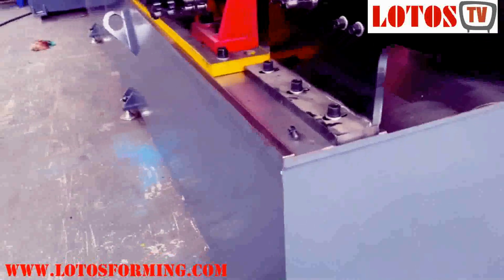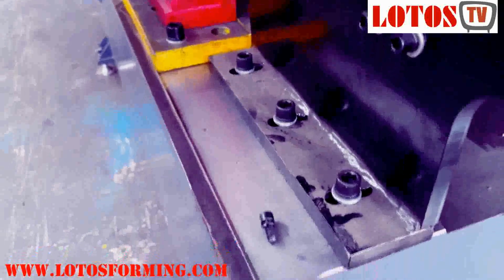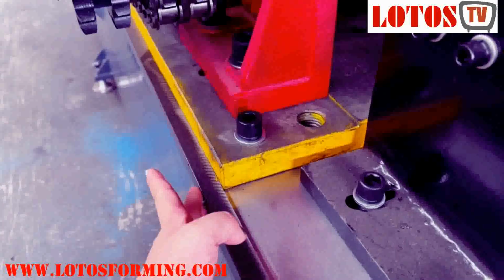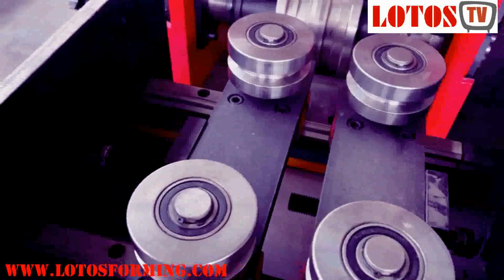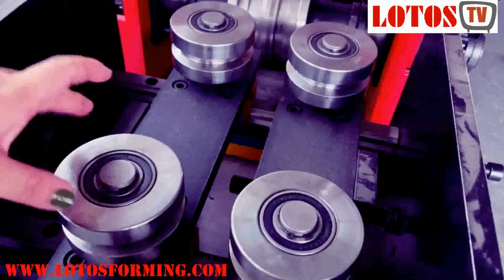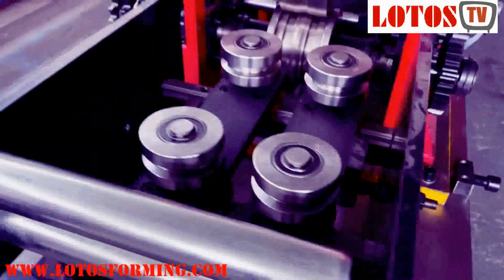The machine body frame is a welded structure with an integrated surface, and the surface is well machined, good enough for cassette loading. This T slot will be used for the cassette to sit against this liner. This is the feeding table, and we can see it is very different from our traditional ones. This is the strip guider with the roller, and this unit can move on this T-rail, which is different from the others.